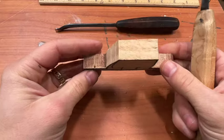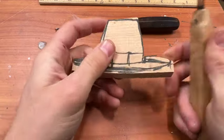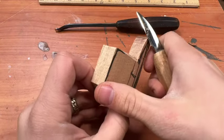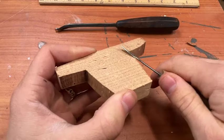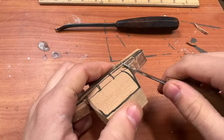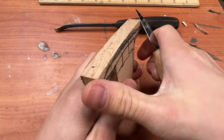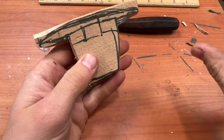All right, so moving on, let's take the corners off, right? Because that's kind of procedure number one when you're doing a whittle like this that you bandsaw yourself. Cut the hard edges off, all right? And this is a little bit of a chippier piece of wood, and the basswood would be just as well, but I happen to have some butternut around, and I thought, oh, I'll make good use of it, might as well.